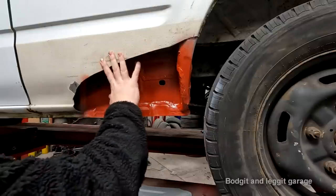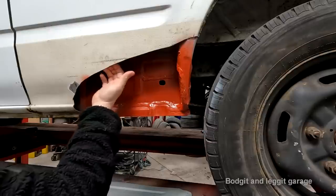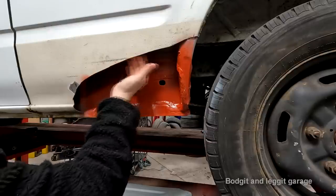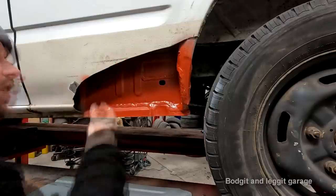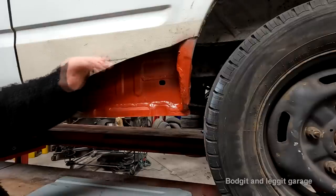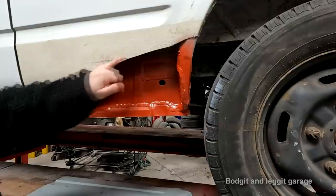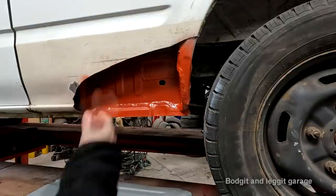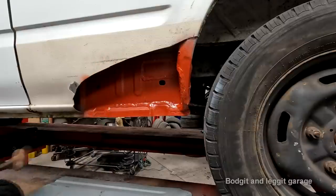And if you put too much heat into this, you're gonna tin can it, which, to be honest, is kind of already tin canning. So that metal is stretched. But again, our lap joint's gonna solve all that. But I can even feel now that is dinted in. So I might do a little bit of dolly work with that.